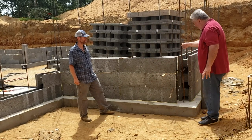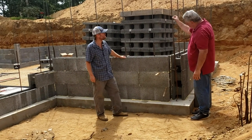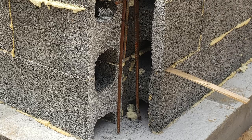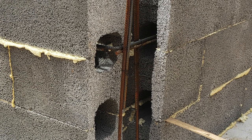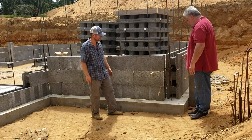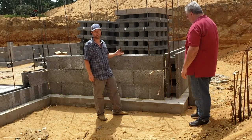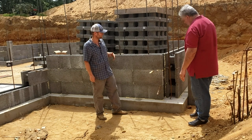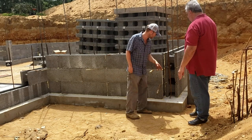You can see the footing rebar coming out, rising up, and then the wall bar. The spec here called for a 30-inch minimum overlap, and they have that. One notable thing: none of the corners are installed yet, even though they have corner blocks. Farley explains that the building inspector will want to verify the rebar schedule. The spec is number 4 rebar every two feet, so they leave the corners out so the inspector can come in and look at the rebar schedule.